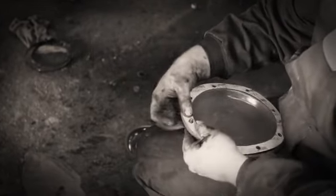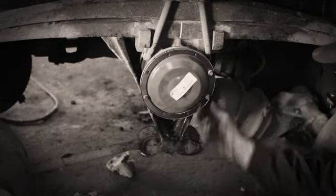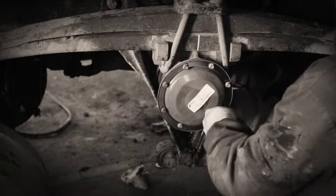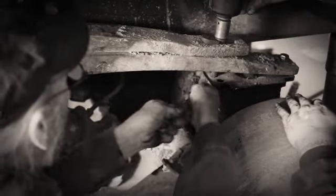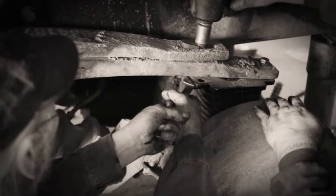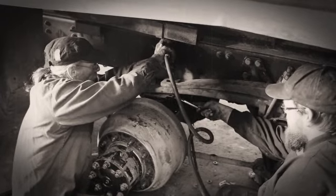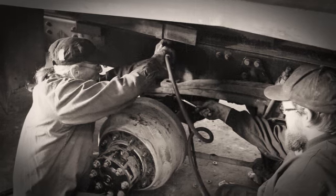Don't forget to replace the gaskets with the new ones. With the new bolster springs in place, our technicians reconnect the tapered leaf springs. This takes some finesse. Oftentimes, the strategic use of four jacks and the port-a-power is needed to line everything up. Maneuvering components that are hundreds, if not thousands of pounds into their proper positions takes patience and precision.